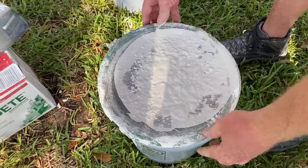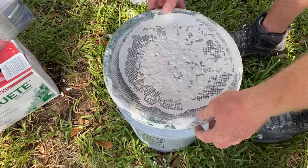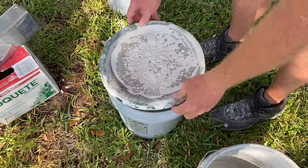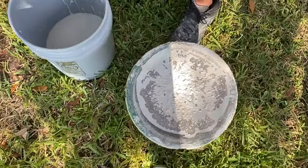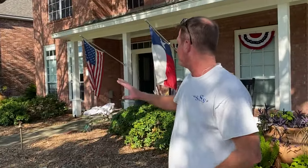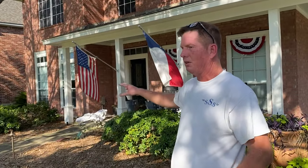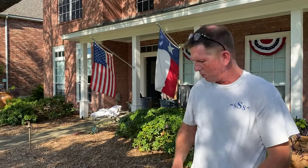So you don't have any trash in your mud. If you want a lighter orange peel, see all the trash? A lot of people don't screen it. If you screen it and there are big chunks, or if it's too thick to go through, it's too thick for a light orange peel. We've got one wall inside a customer's house here in Houston — I just replaced the drywall around the fireplace. So we're going to crank up the compressor and I'll see you inside.